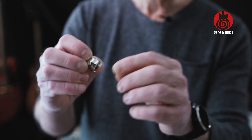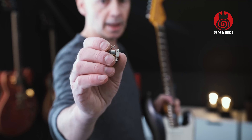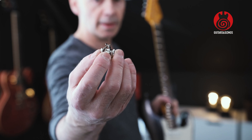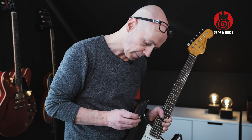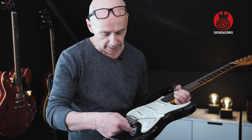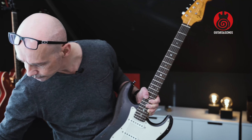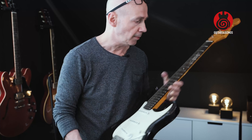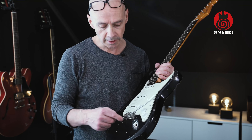This Pure Tone jack has several contact points. It has a double contact for the jack tip, and there is also a better contact for the grounding. The original jack just has a contact point for the grounding to the barrel, which makes it more likely to create a problem. That's why I don't want to try to fix the original one — I'll just replace it so hopefully it will stay good for years to come.